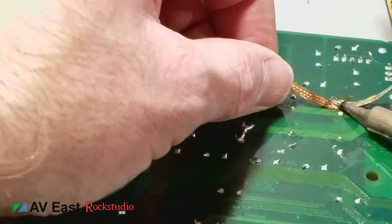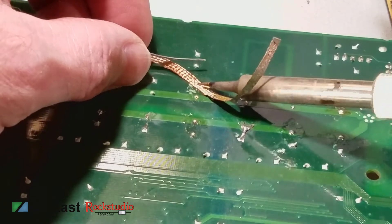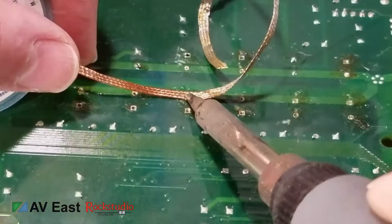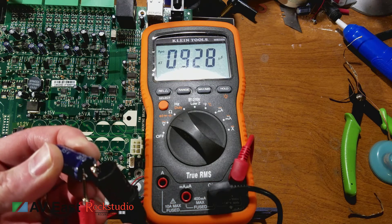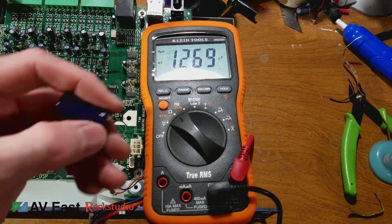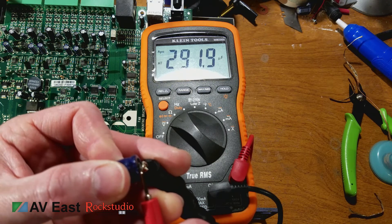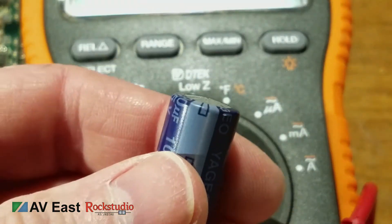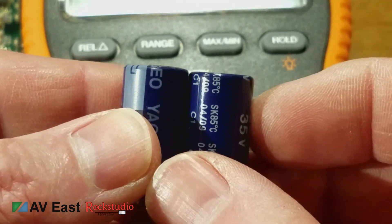You'll eventually see I've switched to a wider chisel point on my soldering iron — you want a wider distribution of heat on that copper braid. You can see what happens when you try to use a solder sucker on holes this small — it doesn't really work. So just persevere and use that solder wick and you'll get through it. I'm going to use my multimeter to test some of the capacitors I removed. You'll see that this one is still in spec and this one is out of spec. These caps have a 20% tolerance and are 1000 microfarad caps, so there could be a difference of 200 microfarads and they would still be speccing out properly. Here's a close-up of a bulging capacitor. If it gets really hot and dry, that whole top segment will pop open and boil off all the electrolyte inside.